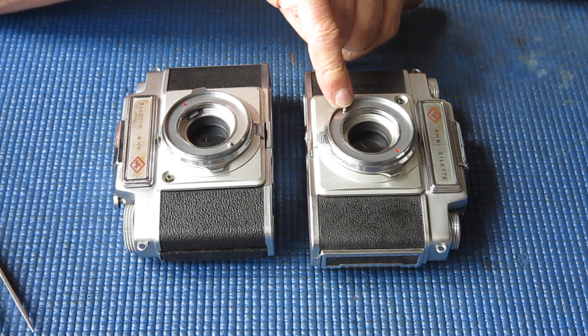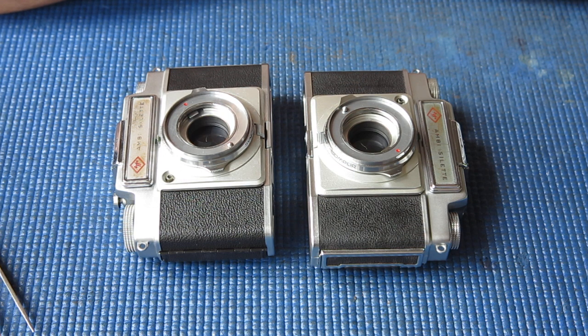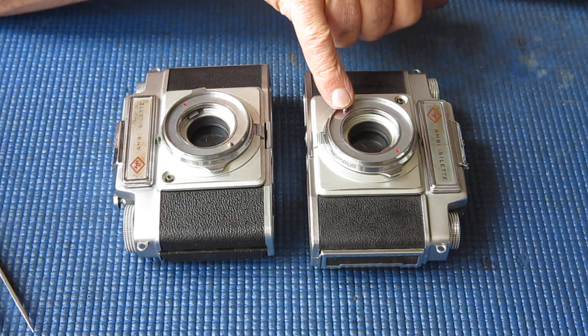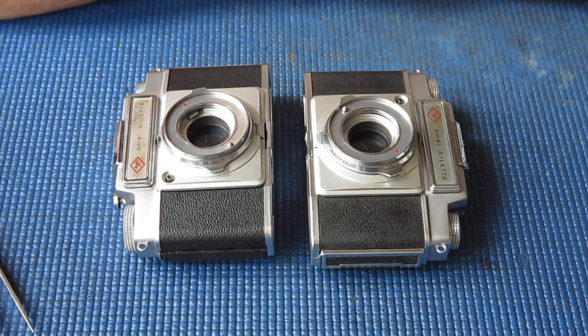So I had to discover what this was, and I spent a fair bit of time taking the shutter in and out of the camera body and adjusting the position of this one or two turns at a time until I had that working correctly, where the wedge at the top of the camera, that curved wedge, was sitting in roughly the right position. And then I had all the fun of making the rangefinder itself work, because of course the previous person had obviously adjusted it the best they could to work with the problem that they'd created down here. So I had to undo all their hard work and try and get it back to working normally.